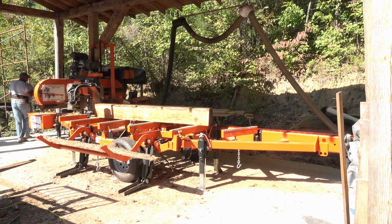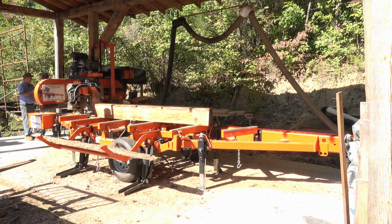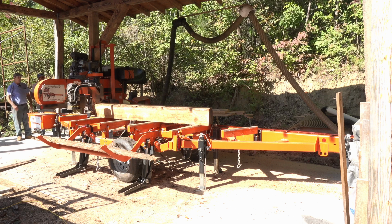Do you see how I did that? You see we barely took the top cut off. I can measure 6 inches across. With most boards you want at least 6 inches, unless you want a 4-inch board, but very seldom. But it gives you 6, it gives you enough to cut off. You still make a 4 or 6-inch board out of it. But if you go down that far, then your second cut will give you a board where you just trim it up and you've got a 6-inch board. That way you don't, because that would have been a wasted board if we went all the way down. So to get the wane off? Yeah, to get the wane off, you'd have wasted 2 more boards.